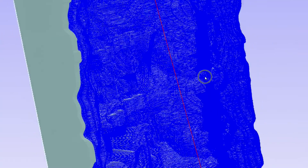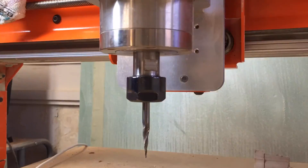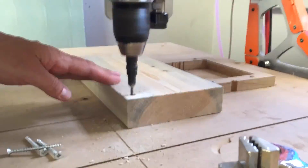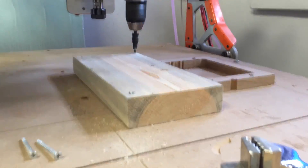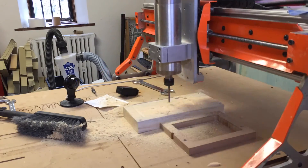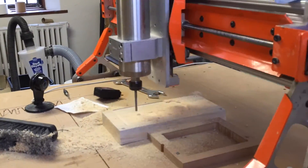Here I am generating the finished toolpath, which will be run with a 1/64-inch tapered ball end mill at an 8% step-over. You can see there is a ridiculous level of detail to a toolpath like this. This is what's referred to as a tapered end mill — the conical shape allows for increased strength and detail at the tip. I got the end mill out of the previous piece of stock. In many instances the use of a tapered end mill allows you to omit the roughing toolpath; however, I was far too aggressive with my initial toolpath and I've got to take a step back and actually use a roughing toolpath before the tapered end mill.